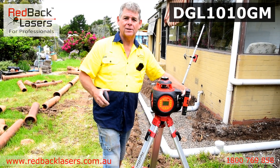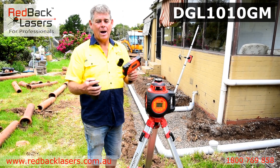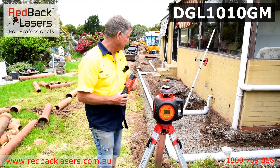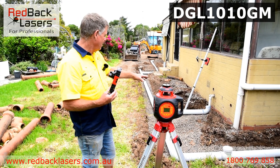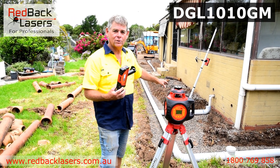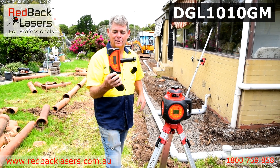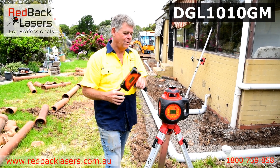It comes with a millimetre receiver so you're going to read up to 50mm above or below your level indicator, which is fantastic because we could be setting out here on top of our crushed rock — it's 13mm — it's going to read your difference, but we're not chasing for zero, we're chasing for how far off grade we are.